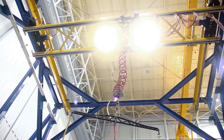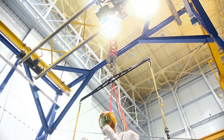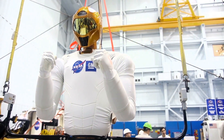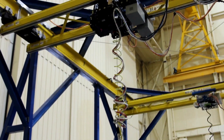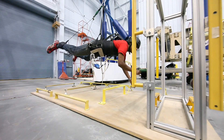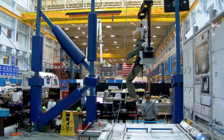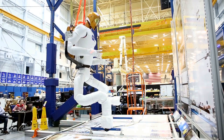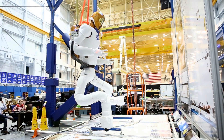The ARGOS system is capable in the vertical direction of lifting a payload anywhere from 0 to 750 pounds. We have two separate transmissions and gear ratios that we can switch between. One gives us high-speed capability for 0 to 300 pounds, moving up to 11 feet per second. The other gives us higher torque capability to lift all the way up to 750 pounds, moving up to 4.5 feet per second in the vertical direction.